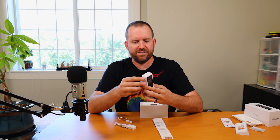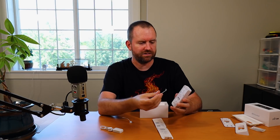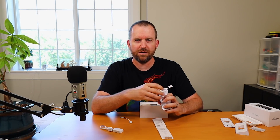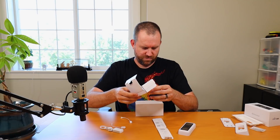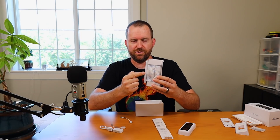The way this device works is you plug it into your standard existing doorbell wiring, and there are some boosters if you need them. There's an interior part that goes on the box where you actually hear the noise, and then there are parts where you connect the doorbell wires to the back of the unit. It doesn't matter which wire goes where — the device is smart enough to know which is the red wire and which is the white wire. That's it for inside the box, other than a couple of silica gel packets — do not eat these.